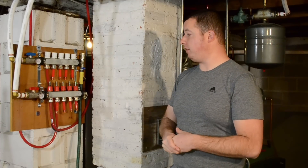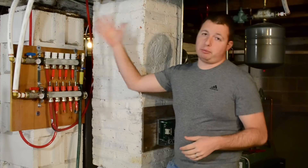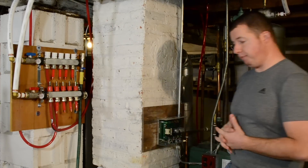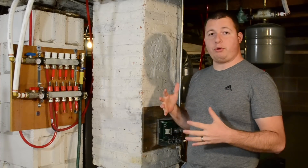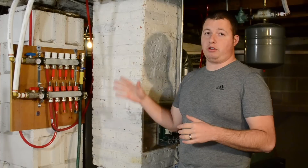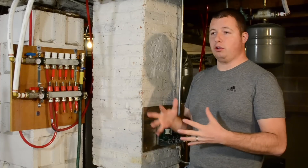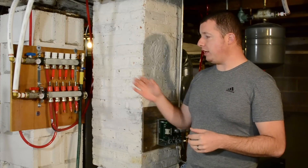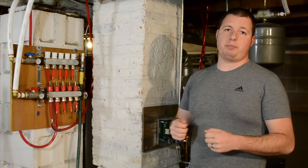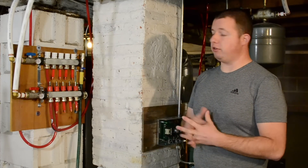We finally got all that stuff together. We used the brass fittings and have everything plumbed up and hooked up to our furnace, so everything is ready to go. The next thing you want to do is pressurize your system filled with water and look for leaks — start from the beginning and go all the way to the end, checking all your pipe for nicks or drips. I did have one leak at my ball valve where I didn't dope up the threads well enough. I ripped it apart, put it back together, and it's good as new.